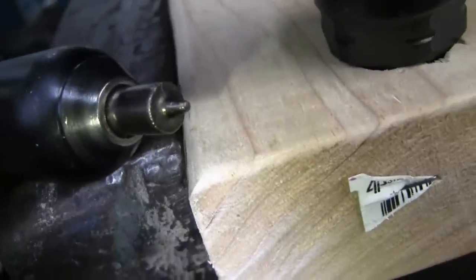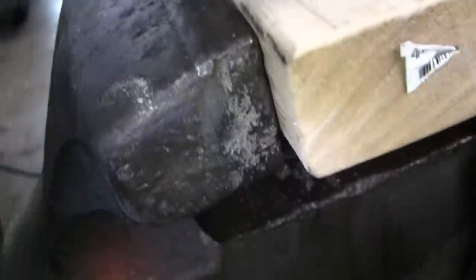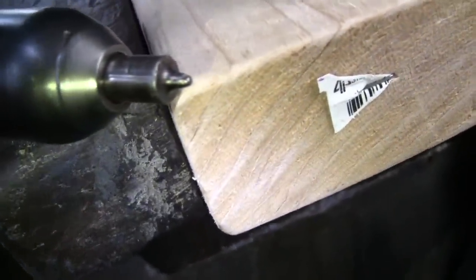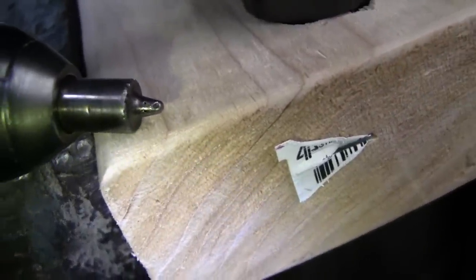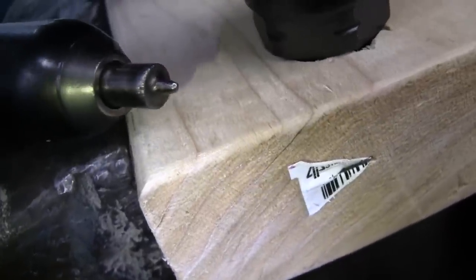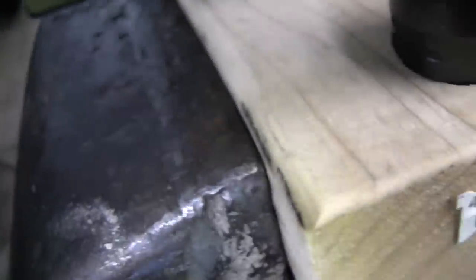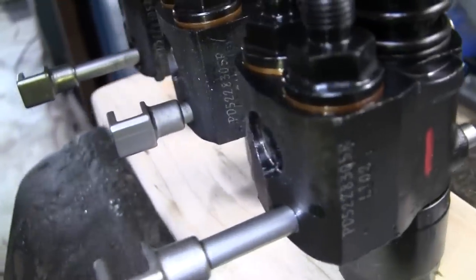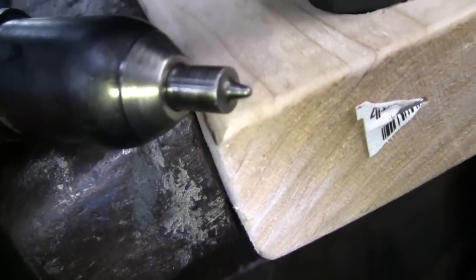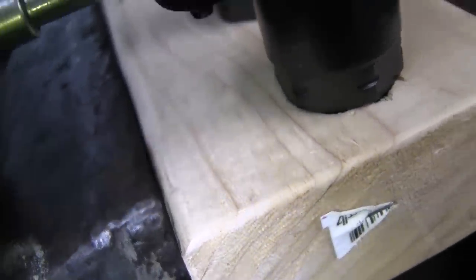Let's see. Number two, not too bad, but there's pitting. One of them's actually pretty bad. Oh, yeah. There we go. Here's number three. Look at that pitting right there in the tip. I mean, all these tips are pretty much shot. This one's just bad. It will run, though, I think. And four. See the pitting on there? Pretty rough. All right, well, I'm going to fill these up, let them soak.